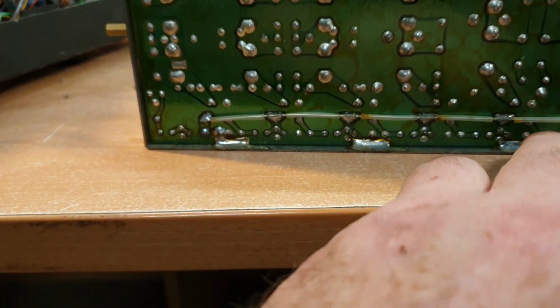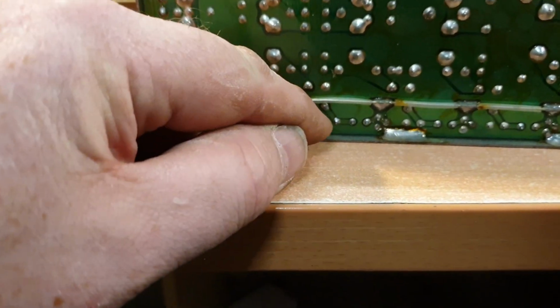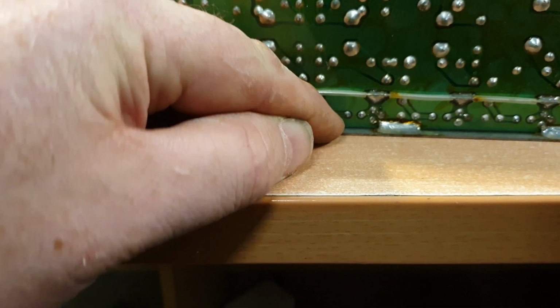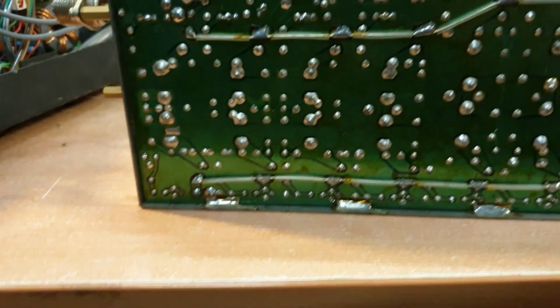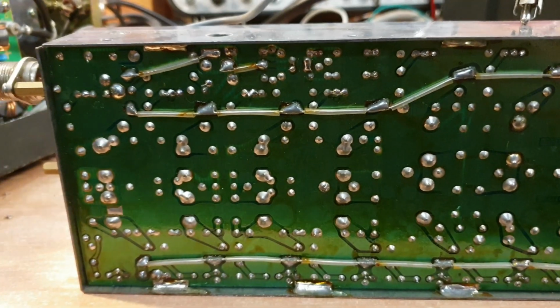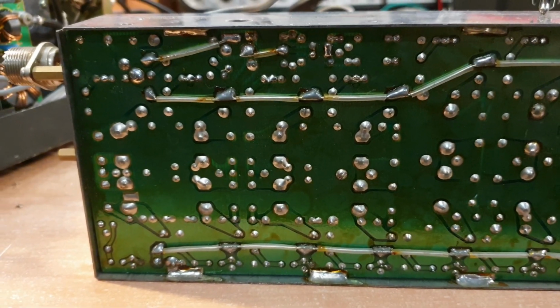etc. Now, at the moment, they look like they're coming through quite well. As a practice, make sure that you're soldering one, let it set. Don't be going so fast that you go to the other and you let the thing drop. It's really easy to do. All these areas here, heavily reflow them. They need it. They really do suffer.